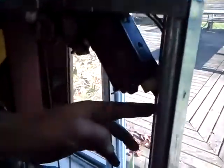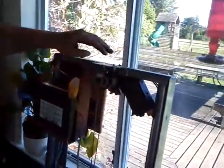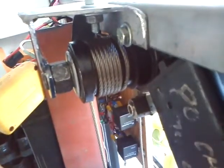The main trap was figuring out how the window winder motor worked. I thought it was positive/negative reversed, and putting positive and negative on incorrectly caused a lot of problems. The other thing I'd probably change is using a cable winding drum instead of the ABS plastic pulley — it's just ABS pressed on and glued, whereas the rest is welded. The motor uses a plastic worm gear on the inside.